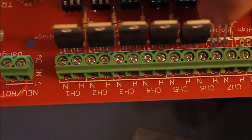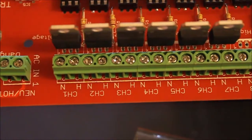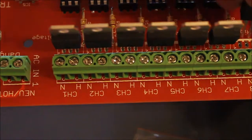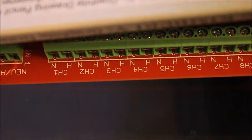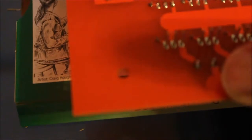I'm not using the heat sinks for this kit — they are available as options. I'll need my handy-dandy pencil box cover here, and we're going to flip everything over. What we're going to do is solder in a single pin for each one of these so that we can verify the alignment for each individual one.